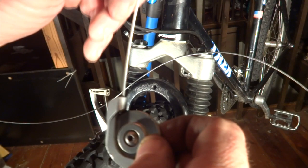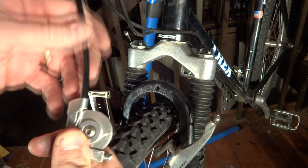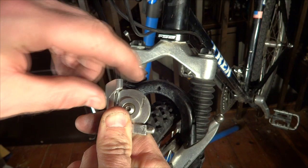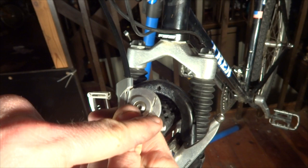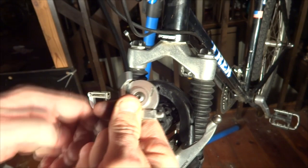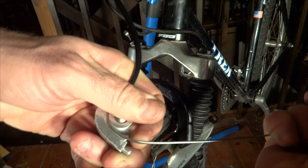Find the end of the cable, slide it down through this hole here, and pull it all the way through. Make sure that the cable housing is fully seated into the travel agent and also into the brake lever itself. Now I'm going to turn this wheel — I want this little slot here pointing not quite exactly up, but around to the one o'clock position. You definitely don't want it too low so that when the cable gets pulled it bottoms out. So with the cable pulled tight up into the housing, I'm going to wrap this around the small pulley here.